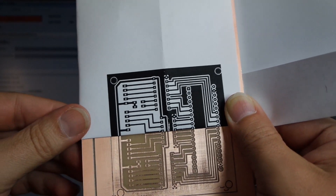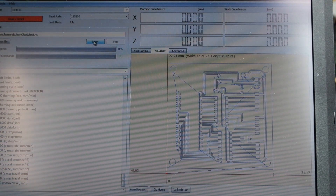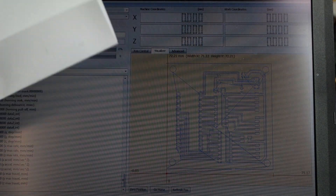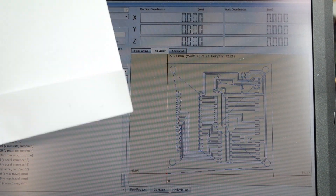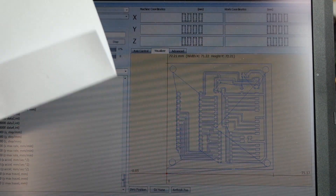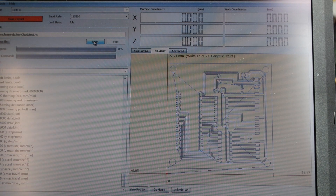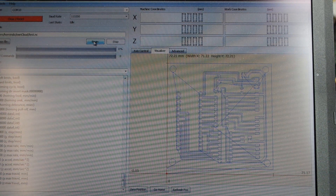If I do a flat cam rendering it's going to look a lot different, because the only thing that will be on the copper are the grooves where the isolation has been milled into the PCB. Although this works better for showing it off, it is actually not quite as good. But for the sake of completion, and because I want to really show the result, I'm going to engrave exactly the same board that has gone through flat cam for isolation milling.